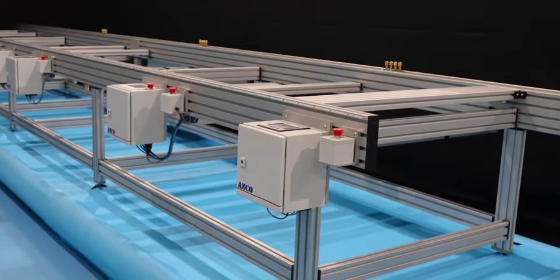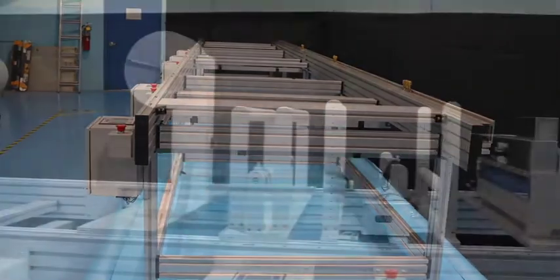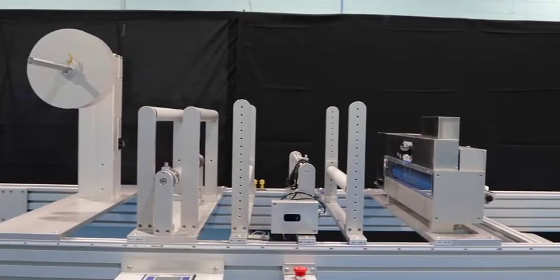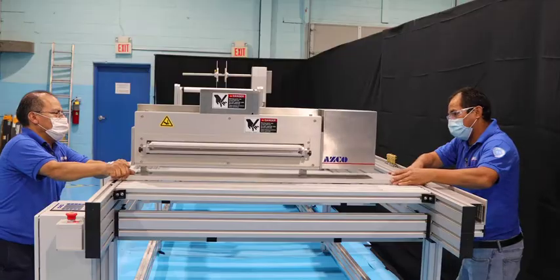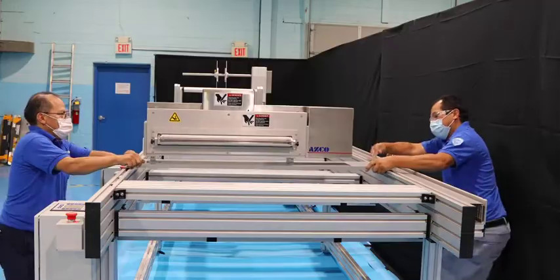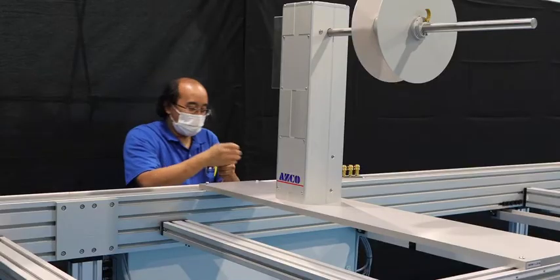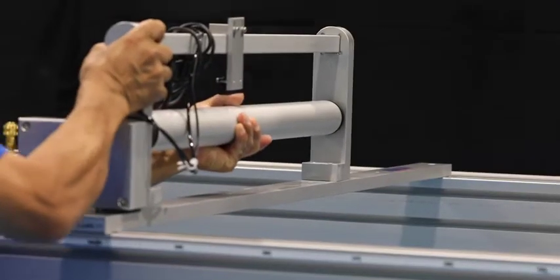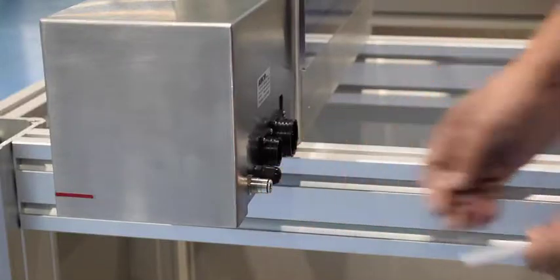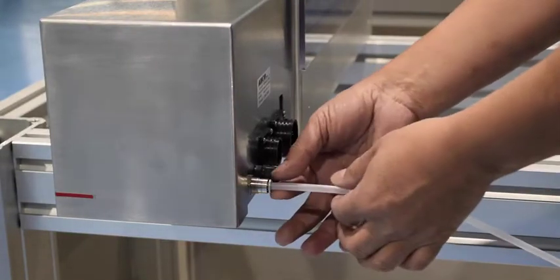At the foundation of the Building Blocks system is the frame, which is designed for ease and convenience and has the capability to handle different modules. The frame has a built-in rail system. All of the modules are mounted onto the rail for easy setup. A measuring indicator strip is placed in the rail system for repeatable placing of the modules. Modules can be installed in different locations. All frames are pre-wired and include quick connect connectors for the pneumatic hookup. Just plug in and begin using.